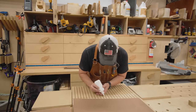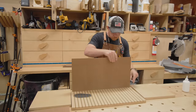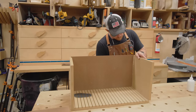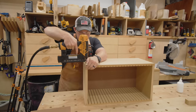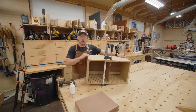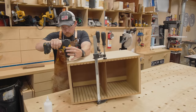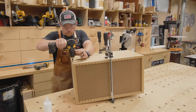Now I can go ahead and assemble this, gluing in the back panel and the center divider. The two side pieces kind of bow out at the middle, so I'm going to glue in just the center divider so I can squish it together and the divider itself will hold the sides parallel. While the glue cures, I'm also going to reinforce the rest of the construction. I only used brad nails, no glue — I don't think glue is necessary and it would just make everything messier. So adding two screws to each one of these connections should be just enough.